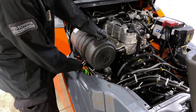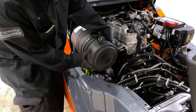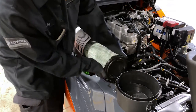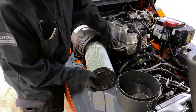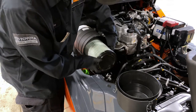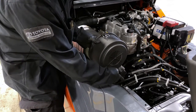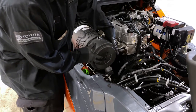With the hood open, you will also have access to the air filter. Remove the cover by opening the three clips. Once the cover is off, inspect the filter to make sure it is free of debris. When putting the cover back on, make sure the filter valve is pointing in a downward direction — this will allow the filter to blow debris to the floor.